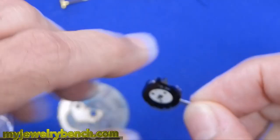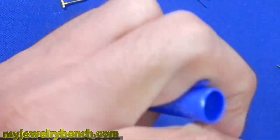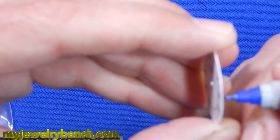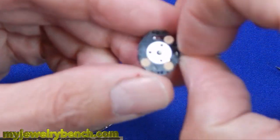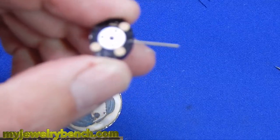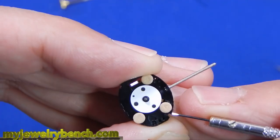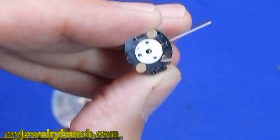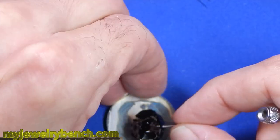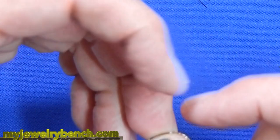Here I'm just grabbing a new movement and I'm going to get it ready to put the dial and the movement together. First things first, I want to mark the back side of the dial where the three o'clock position is. This particular movement doesn't fit into the same dial feet as the original, so I've used some dial adhesive — basically double-sided, real sticky thick pads — and we're going to remove the protective cover. There should be three of them here.